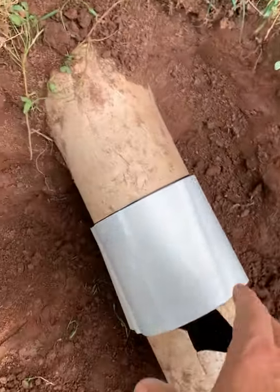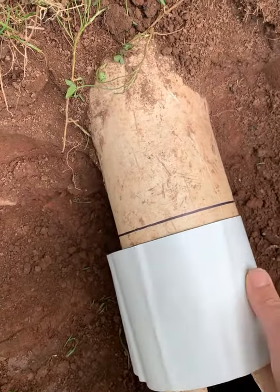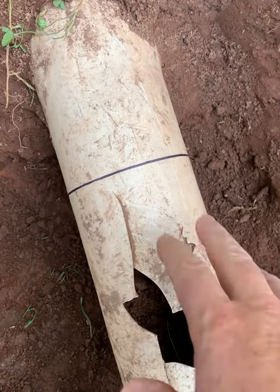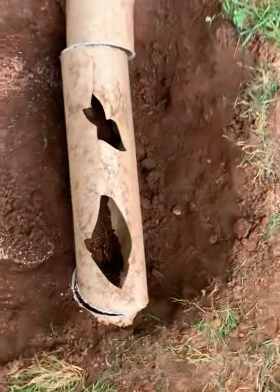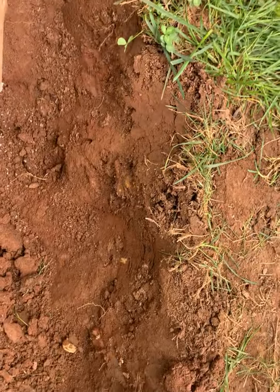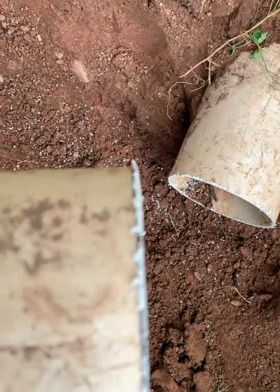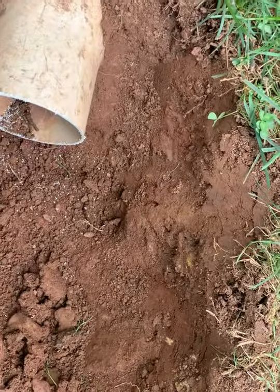Okay, so now I've used a sharpie and I've marked the line along the edge of this piece of flashing, and we're going to put the sawzall on and make the cut. So we made the cut — you see a nice square cut now by using that technique, cutting along the line. You can see how it stays nice and close along the whole way. That's a very good guide.